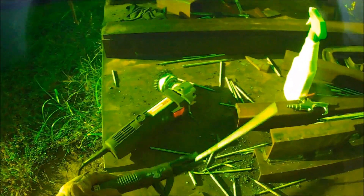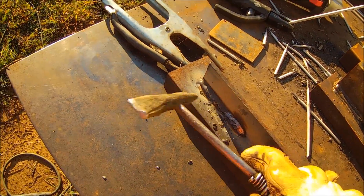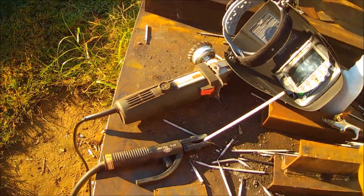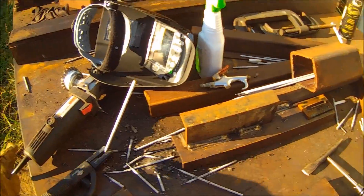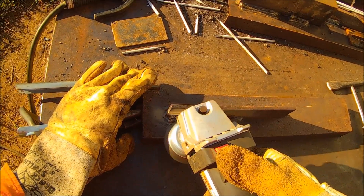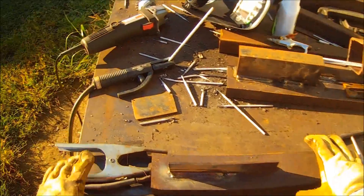Not much movement in that rod — you don't want to go more than, well, that's my way of thinking on it, everybody has a different way of thinking. I don't like to run a weave that's any bigger than twice the width of that rod. I think what you're doing is you're taking your heat away from where you want it — you want it in the toes and in the root, most importantly in the root. The more you start spreading that puddle out, I think the more you're losing your heat.